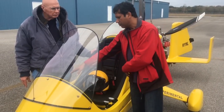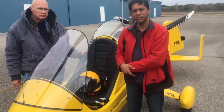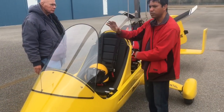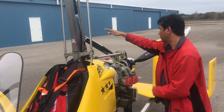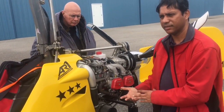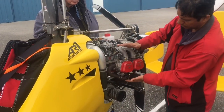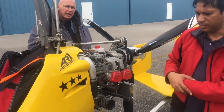There's some labor work to install latches and such, but they essentially keep the same machine. The canopy will also have a rear cowling over the motor for airflow. It's designed to accommodate a six-foot-two person comfortably in the front seat. The cowling goes over the top and comes down about here — it's a top cowling without full engine enclosure on the bottom, so you don't need a complete firewall system since it's still open on the bottom. It follows the curvature so you still see about this much of the engine, but the whole top is covered, with air vents.